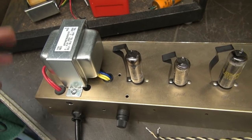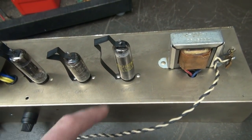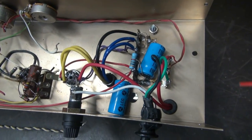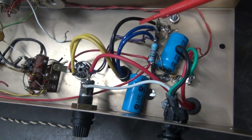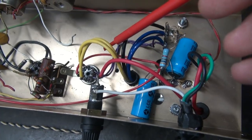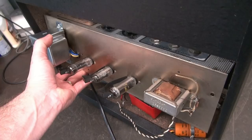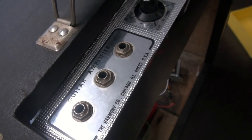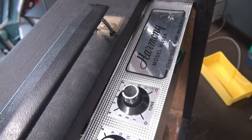Here's a progress report. New transformer is in place. We have a 6X4, 6AU6, and 6AQ5. Let's look underneath. Here's the underside: new filter caps, screen resistor, balancing resistors for the filaments, the 6X4 is wired up, high voltage lead coming off. I still need to get in here, rewire the filaments, and clean that mess up, but we're getting close. As for the chassis fitting with the new transformer — it slides in, comes up into place, the speaker board is in front of it, and it seats right in there like it should. I've got a good inch and a half of clearance behind that transformer.